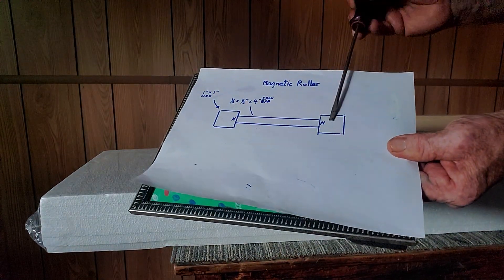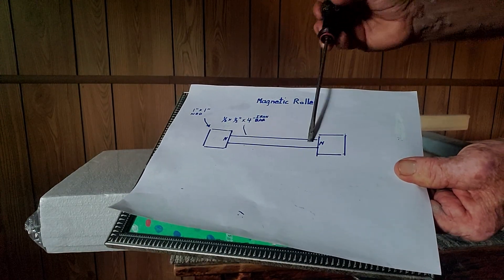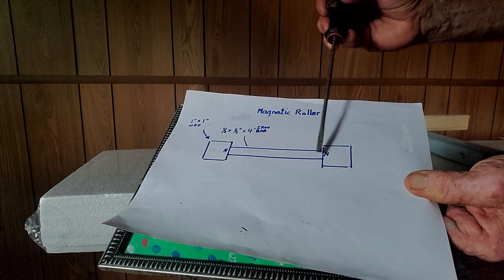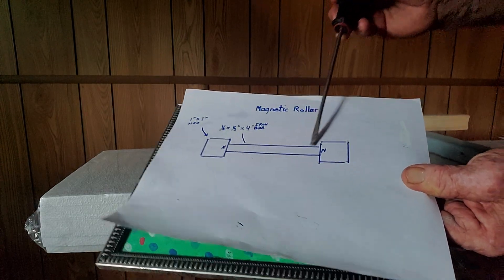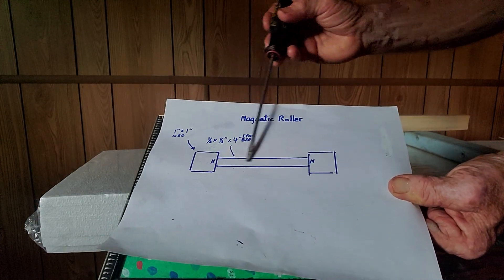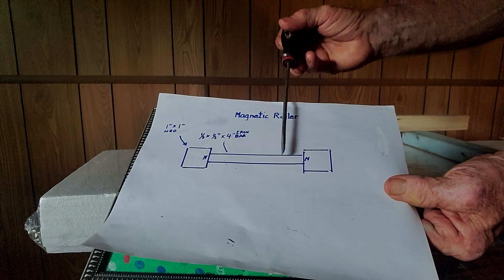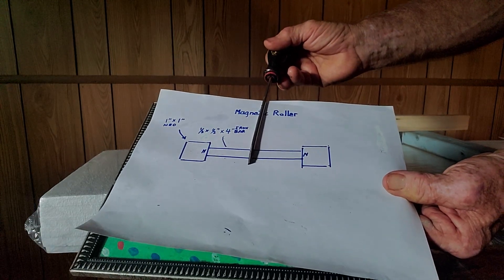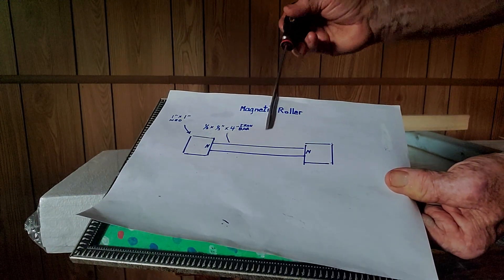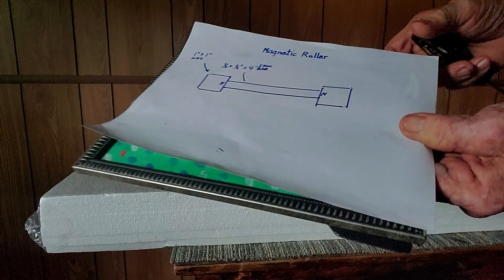This is my magnetic roller. These are inch by two inches, and in between is an iron bar — half by half by four inches — just as long as it's smaller than the diameter so it rolls. I have a north and a north, and I've never had a problem with that as long as there's a metal bar in between. It gives space for this to arrange itself so it's not directly opposite. The north comes out, and right here would be the maximum field, then it tapers down.